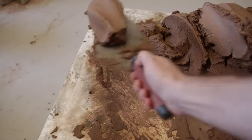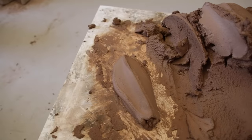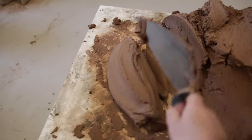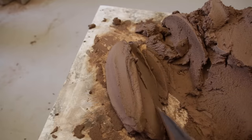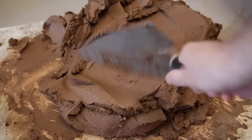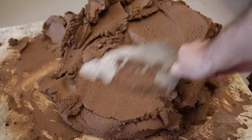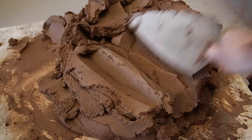You'll feel the weight of the mortar as you're turning. You can take as much as you want over time, when you build your strength up. That's just to make it more uniform as you pick it up. The other way you can do it is just make a little bit of an impression and dig your trowel in and you've got that — so just dig it in and take it. That's another way of taking some.